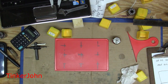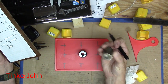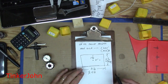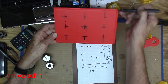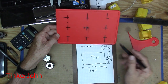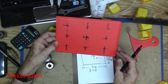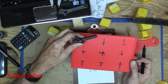I've already got the board laid out. I just put a couple of the collets down here — as you can see, some of them I haven't even taken out of the wrapper, the quality on them was so bad. The layout I just did with a little Sharpie pen. The dimensions I used for the ER-32: my board is eight and a quarter this way and five and a half this way, so I just found the center spot and started marking out from there. I marked two inches from each side and then an inch and three quarters on the vertical side. I'm going to take this over to the drill press and center drill each one of these holes.